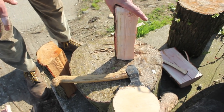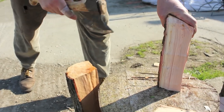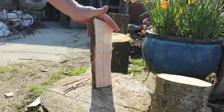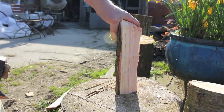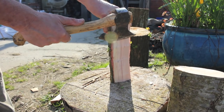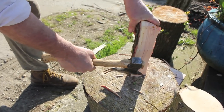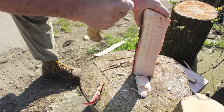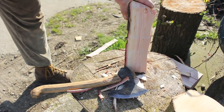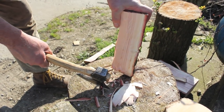You can see we started with the same thing — it's thicker one side than the other. We want to thin those sides down and make it smooth. I'm working on a fairly low block today — you want to be in a good position when you work. If you're right-handed, put your right leg back so that if the axe swings through, it's not in the way. That also gives good support for your back. I'm going to tuck my thumb here — I've never chopped my thumb off yet and I don't want to start now.